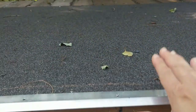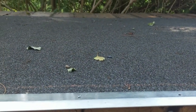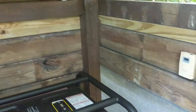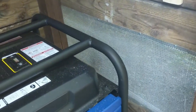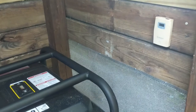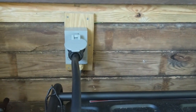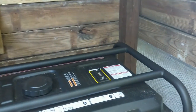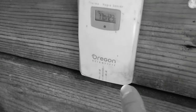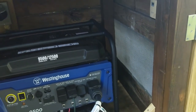With the shed itself I did make some changes — I put on rolling shingles. I also learned quickly that the box fan I had wasn't going to work. It's 84 degrees now, but when I ran the generator it went up as high as 140 degrees — really really hot. So I had to move the inlet box to the cooler end, opposite the exhaust. The regular box fan basically melted and burned out within one use, about a day.